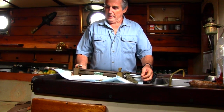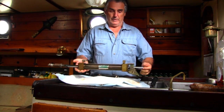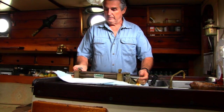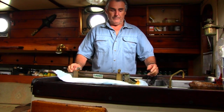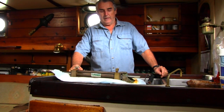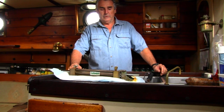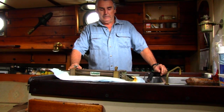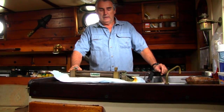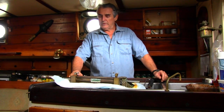So I guess maybe a shaft on that ram, which is this part here, must have a scratch or something, because it does not hold the pressure. In 10 years' time it was developing more and more of a leak. From the beginning, all we had to do was pump some air because it's pressurized, and then very seldom add some oil, but it got to the point where it became a nuisance.